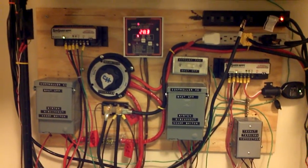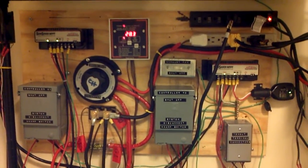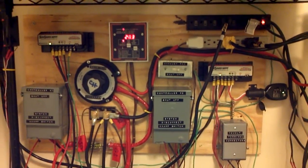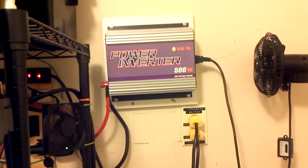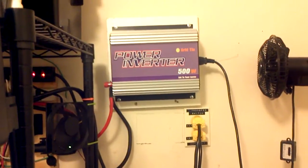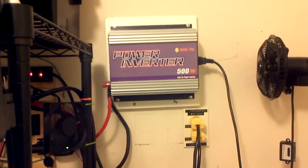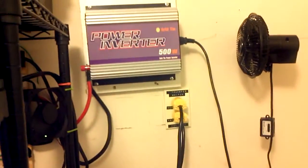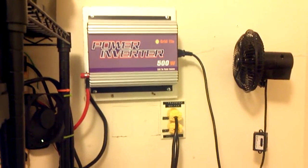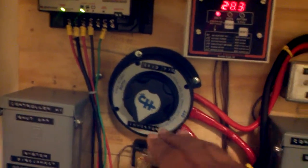The other videos cover all the parameters and environmental conditions of my experiment. In general, if you have good sun and favorable weather conditions, it is feasible to implement this on your own. As always, safety is critical. These grid tie inverters are cheap, but they are not UL listed. I will not run them when I'm not at home — I don't trust them enough. I have a timer, which is fine when I'm home, but when I'm away I unplug the unit and also switch from both to just my single inverter, effectively turning it off.